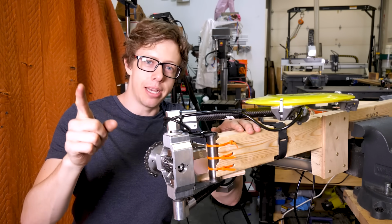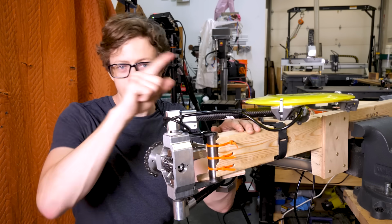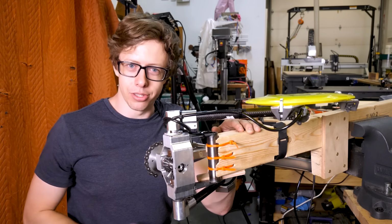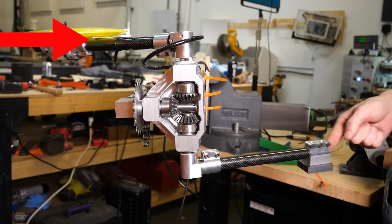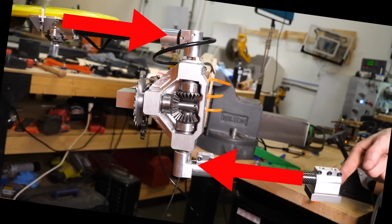But what you might not realize is it's actually a circle, and it's possible to do something that you think is really smart, but you actually wrapped all the way back around to stupid, which is exactly what I did right here with this torque problem. Looking at it from above, things are great. All the forces cancel out. But from this view, the top arm is pushing this way, and the bottom arm is pushing that way, which wants to twist the launcher, like a lot.